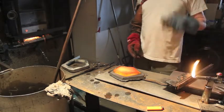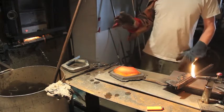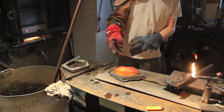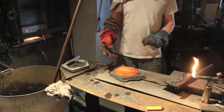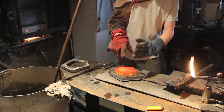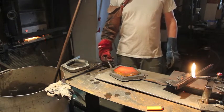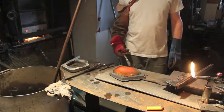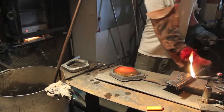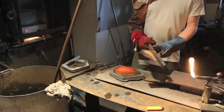That's it — I have a nice continuous flat surface with no air bubbles, because as I was pouring I didn't jump ahead of my pouring flow. What I did is add to the flow as it moved across the mold. I also have a kitchen knife here to just elevate it a little bit and check it, and when it's ready I use the kitchen knife to put it onto the carrying tool to take it to the annealer.